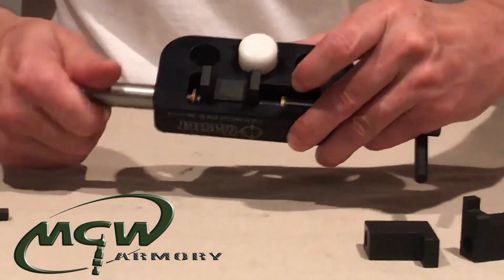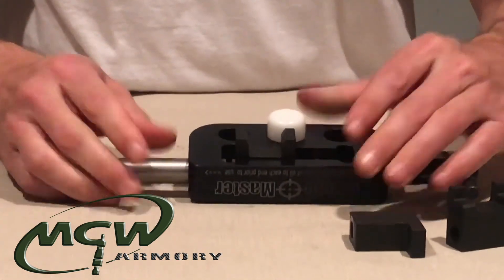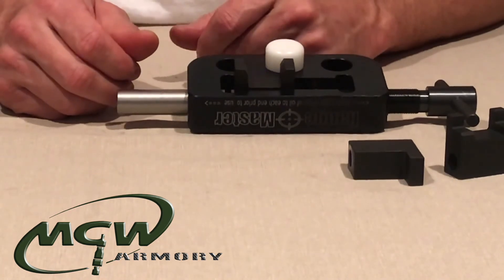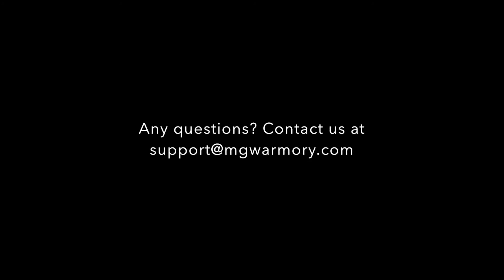You need to be aware that when you put it in, you flip it around and have that chamfer go up against the shoulder. Let your block slide in, make sure you have a bronze washer on each side, then screw it down and tighten it. If that washer is in backwards and you notice it locks up after changing the blocks, that's the first thing to look for — and that's going to be the solution to any issues you have.